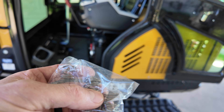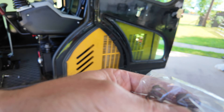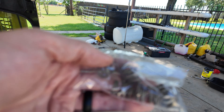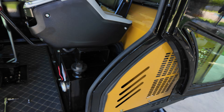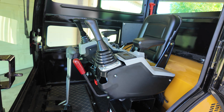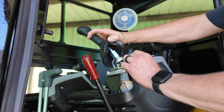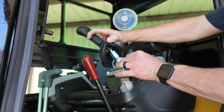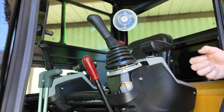Here are the springs, and pilotspringmod.com is where I got these. These are the gen 2, copper — looking at them a little bit closer it looks like they are oxidized a little bit, which would be telltale that it is copper. All you have to do is lean this in here, push that piston down, drop in the spring, rinse and repeat — do it three more times on this side.